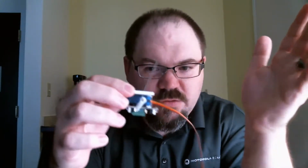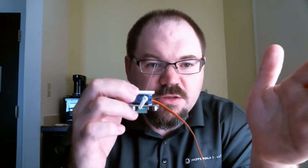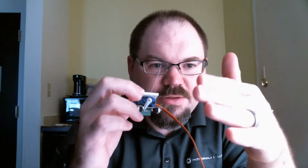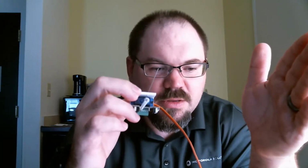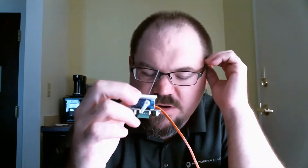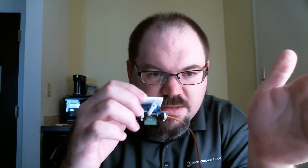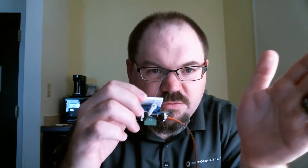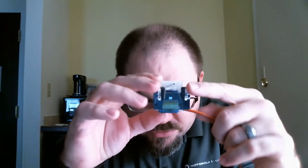And the important part behind that is when you're running your power through your track, when you get to the switch, you actually want to do what's called power routing to prevent any kind of shorting, or you can actually cause polarity changes if you're not careful. So these switches are used to control that routing of power, depending on if the track is thrown or if it's straight. So that's what these little switches on this board are for.